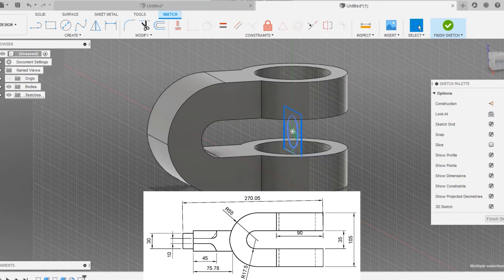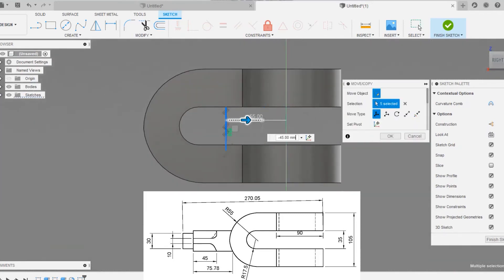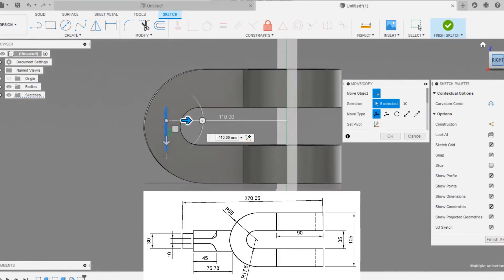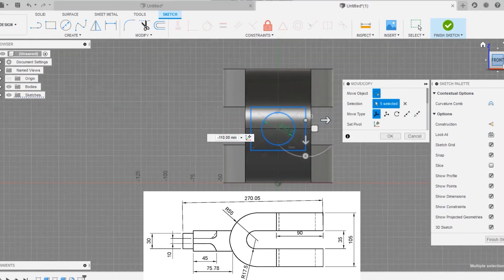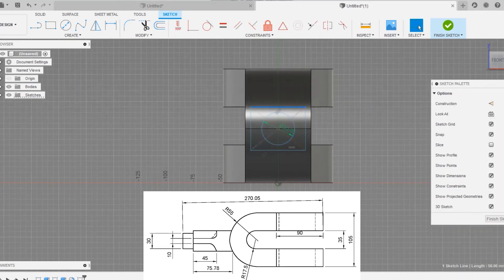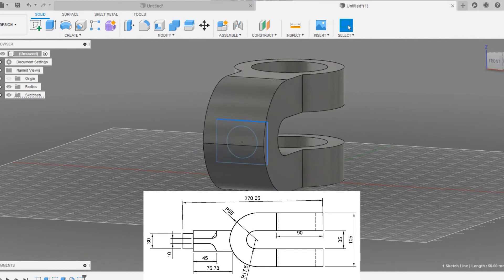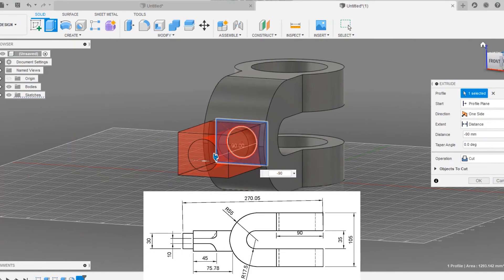Move both the rectangle and the circle to the center position. If you extrude at the wrong position, the solid will form at that point, which we don't want. Drag it to the boundary position exactly so it can join material to the fork end. Select the square face to extrude it on the opposite side to around 90mm and choose the operation to be join material.